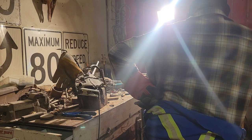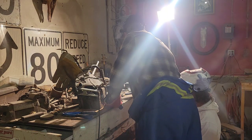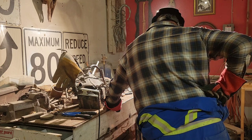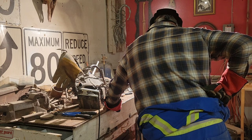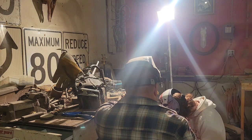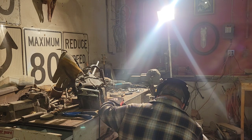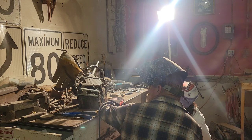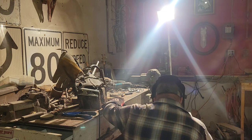It actually kinked the wire right before it feeds into the hose, if you will. And when that happened, we'd have to stop, pull the wire out, cut the wire, then refeed it in and put in a new tip. Eventually, I got smart and cut the tip really short so it wouldn't protrude out so far and therefore have a lot less chance of melting closed again. It was very frustrating, but we eventually figured it out. But it did happen a few more times.